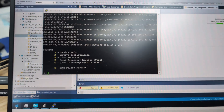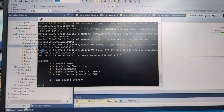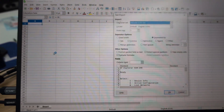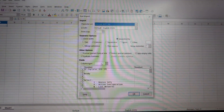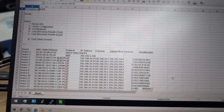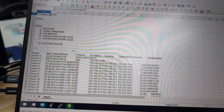We'll get that list again. If you right-click the gray area up here, we can copy all to clipboard. Then you can open up any spreadsheet editor — on this image I have LibreOffice, which is free to download. We're going to hit Paste, then use a comma separator, and click OK. That gets them all in here that it was discovering, so we can do a little more work on it now.